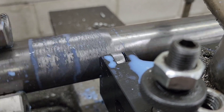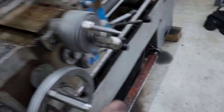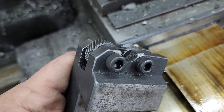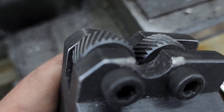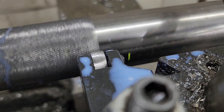You really get a knurl as deep as your tooling will allow, so it's limited by the depth of the groove in the tool — the knurling. The depth on this would be an extreme knurl, so you can have knurling as deep as that groove before you base out your knurling tool.